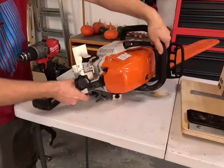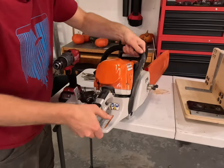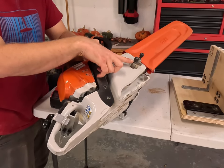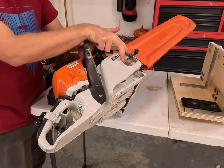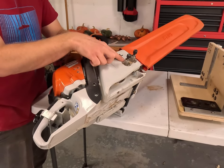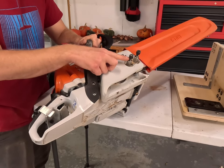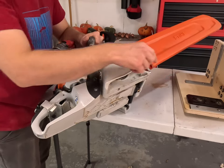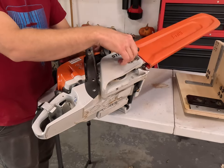And then to connect the saw to the saw carrier, I've got these adapters. So these are female to male adapters. And you just take off the two nuts that hold the chain or the bar. Normally you take those off, and it's an M8 for steels. It's an M8 female end. And then I go to a 3/8 inch male threaded end. And those will go through this black plate here. And these I got off McMaster-Carr, so I can put a link on that below as well.